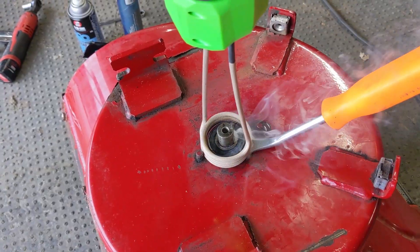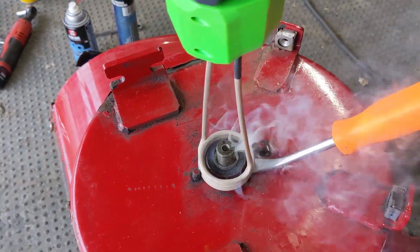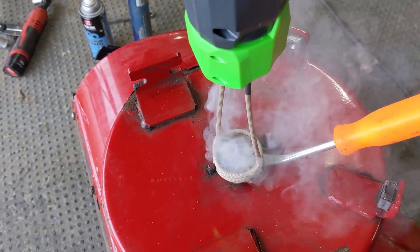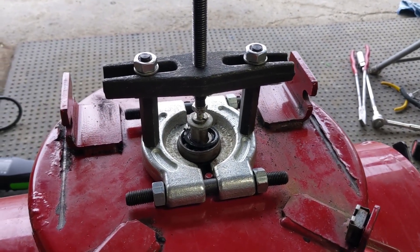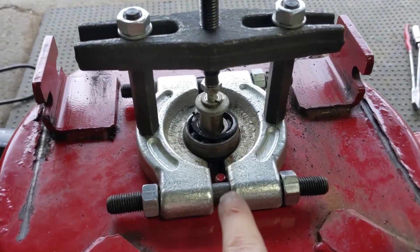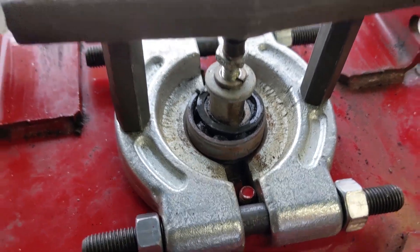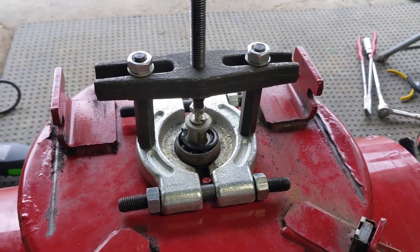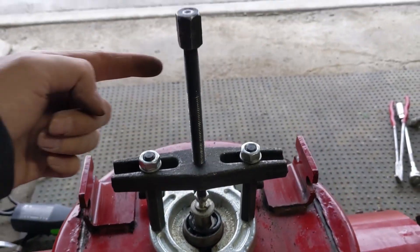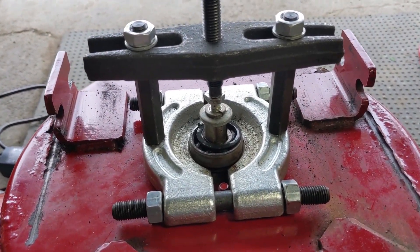I've opened the garage door to get more ventilation because this is a 2RS bearing — rubber seal on both sides — and it is packed full of grease, which we're burning off while heating up the metal. I've lifted the impeller shaft up so there was just enough room to get the coil under there. I had to use the larger one because there are threaded bolts that hold the bearing flange in place. You take the uprights, thread those in, take your bracket, thread that in, and then tighten down on this up here to pull on the seized bearing.